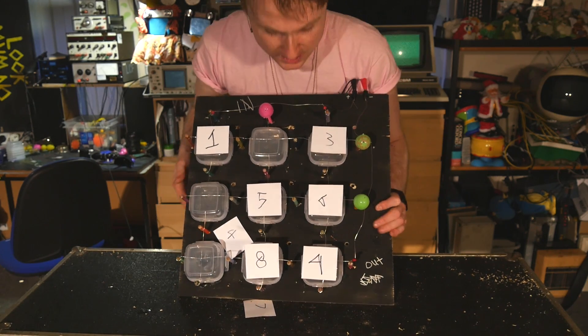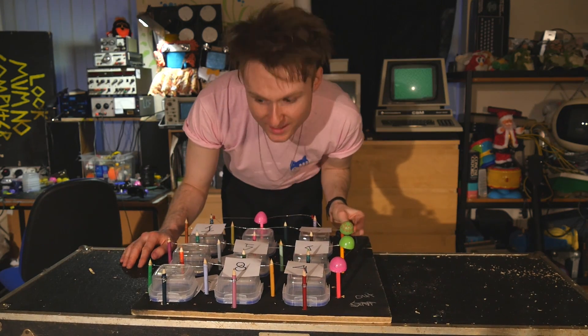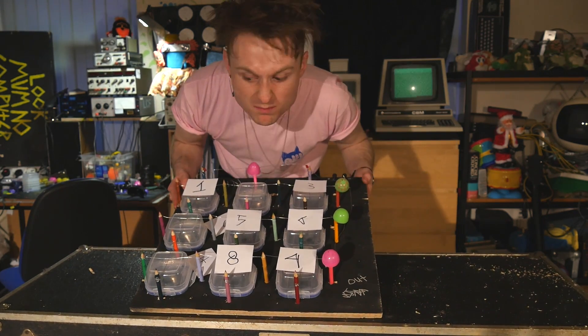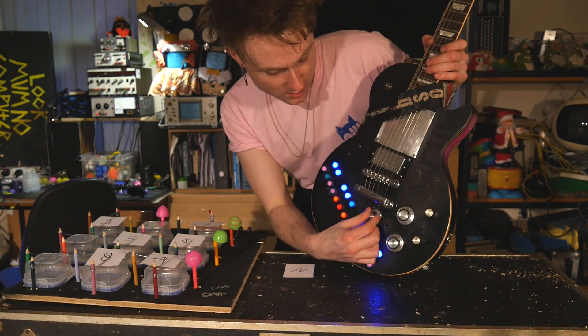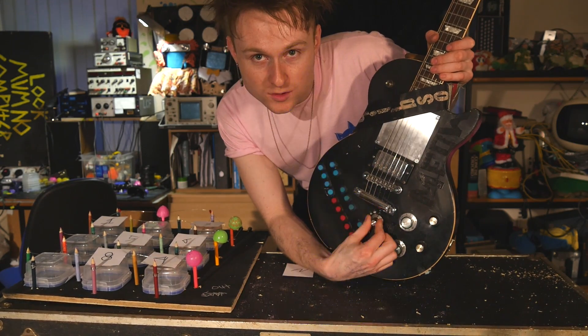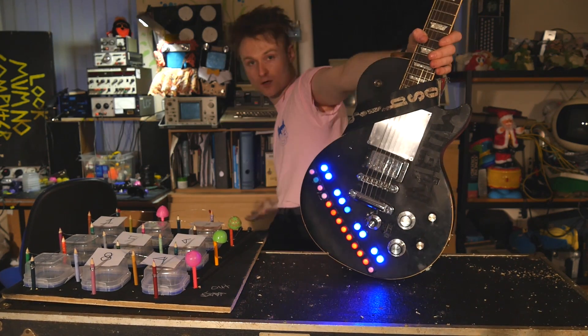You can solve ghosting by scanning each row separately. You can also scale this up — four by four gives you 16 buttons with just eight pins, or five by five gives 25 buttons with only ten pins. This is just the basic concept. Next time we'll go deeper on how to handle this properly, like in MIDI keyboards and other things that use button matrices. Hope that was a little bit of help!